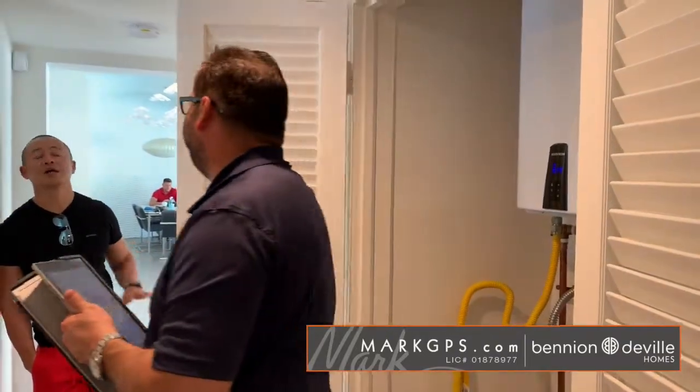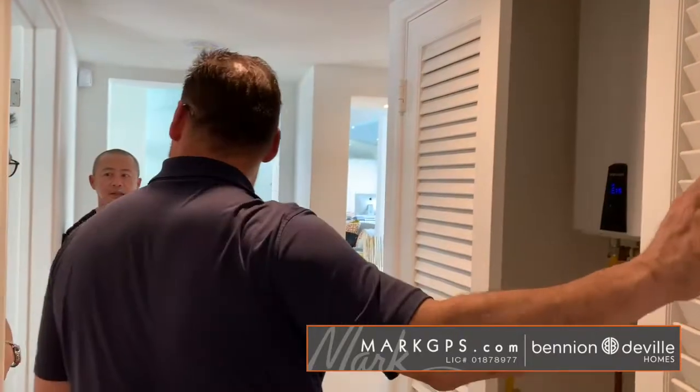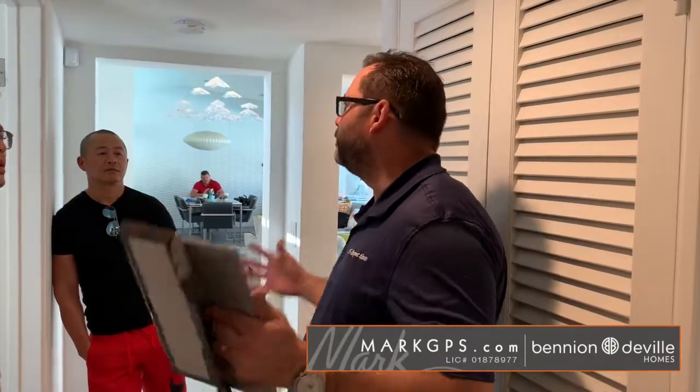The inspector does inspect pools as part of the home inspection. Let's finish the list first. The dryer vent pipe is a paper material that looks like aluminum foil — it should be a metal flex material.